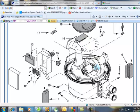So if you want to diagnose your blower, keep in mind you want to work in this electrical panel, and this electrical panel is hot. It contains either 240 or 120 and 24 volts. All these terminals, this is your hot leg. These are your normal 24s. And this, depending on your voltage, is either hot or neutral. It depends how the man wired it. So you always want to go to a meter.